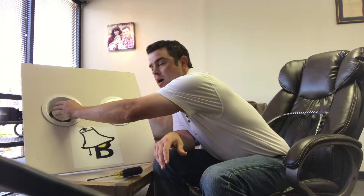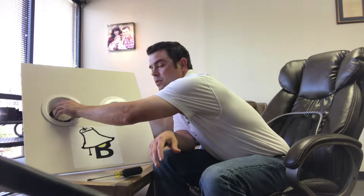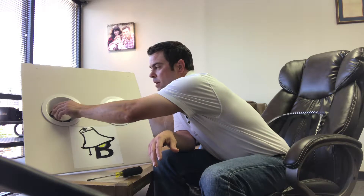Another thing you can try is if you screw it back in and you're still getting flickering, or you're still going through light bulbs like crazy, you want to check your switch and make sure that you still are getting a good connection at the switch. Sometimes a faulty switch will cause flickering in your light bulb.